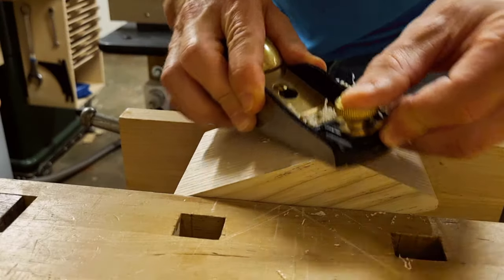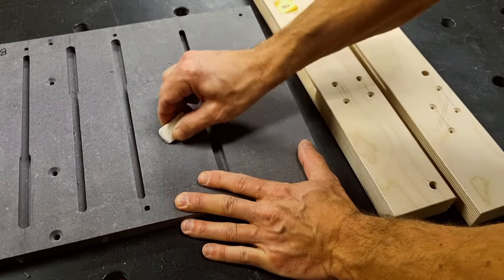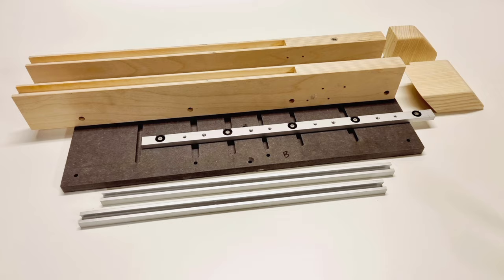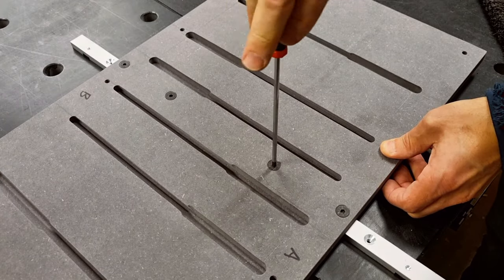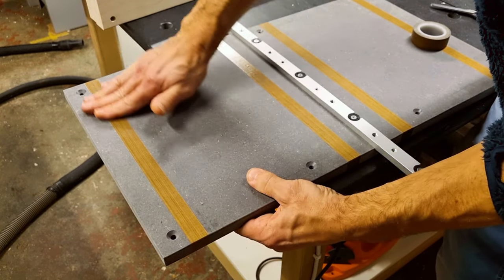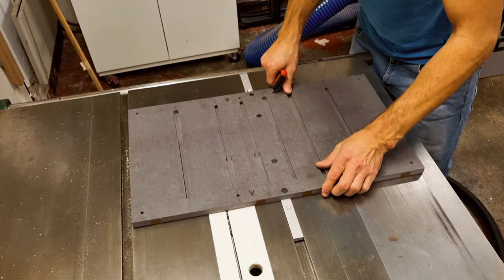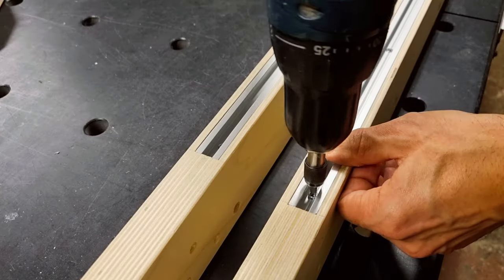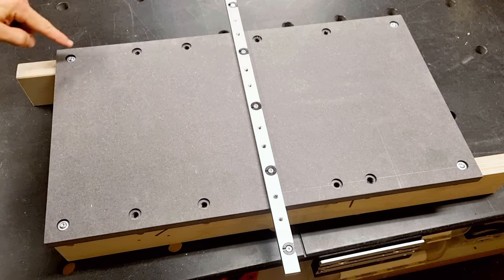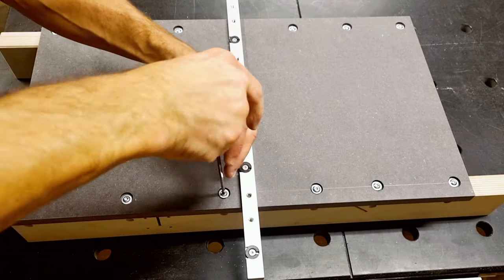I do a bit of shaping on the blade guards to remove sharp edges and make them look nicer. I remove the pen marks, sand all parts to remove sharp edges, and then it's time to assemble the sled. I begin by attaching the miter runner. On the back side of the sled I attach four strips of low-friction tape. I then tune the expansion discs on the miter runner to get zero free play movement. I install the T-tracks, then the cross dowels, and then it's time to mount the fences, using one screw in each corner to start and squaring the fence against the base plate, before installing the remaining screws.